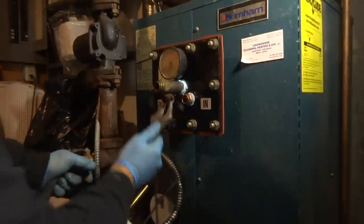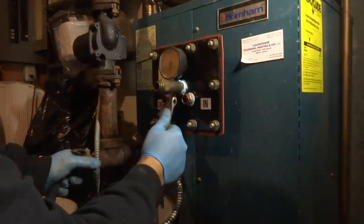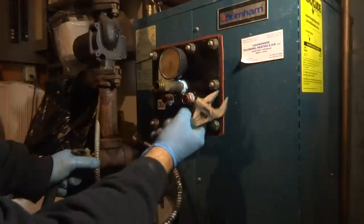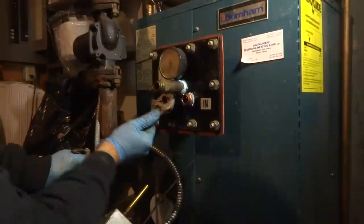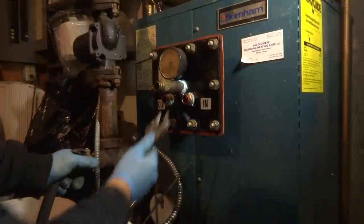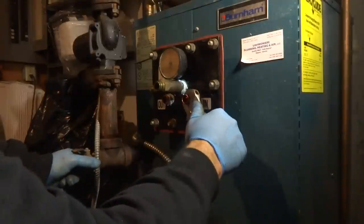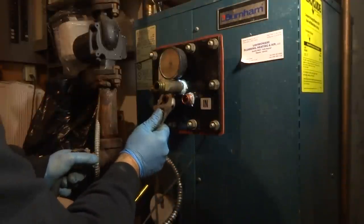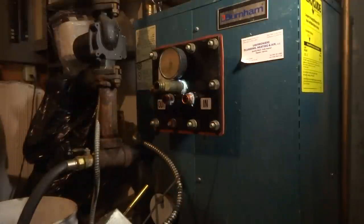Make sure these are tight because you don't want these dripping. These are welded in there. That might be brazed. That might be where it was leaking before. I don't know. I was just going to change this and then I came and I seen that tankless was all choked. I said, that's no good like that. We'll clean these and we'll put two street elbows in right up to couplers.